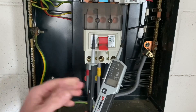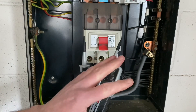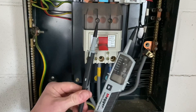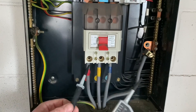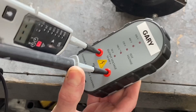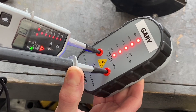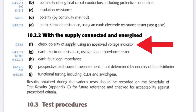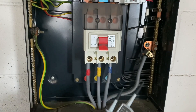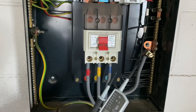I'm still going to check this again on my proven unit, because that's the practice I follow. But you saw clearly this went live, dead, live, live — self-checking the instrument. So that's it completed. We've carried out the test for checking supply polarity — the first live test according to BS 7671. I hope this video has been some help.